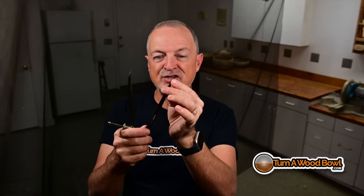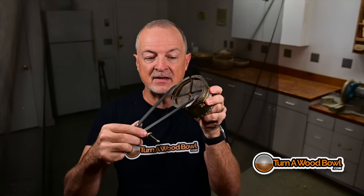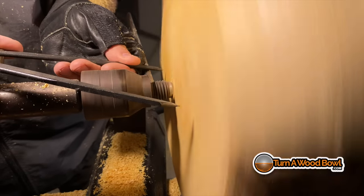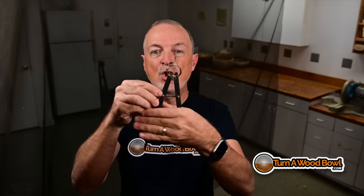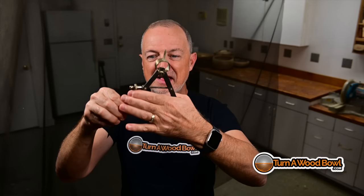If you've seen any of my turning videos, you've probably seen me use these metal dividers. These are fantastic — I've used them for years. They have great solid metal construction and just work. They do a great job of scribing my tenon size. I simply bring them up, size them to the jaws on the chuck I'm going to use, and then transfer this directly to the turning so I know how wide to make the tenon on the bowl. This particular set opens really wide — even if you have a really big chuck — and is super adjustable down to a small chuck.